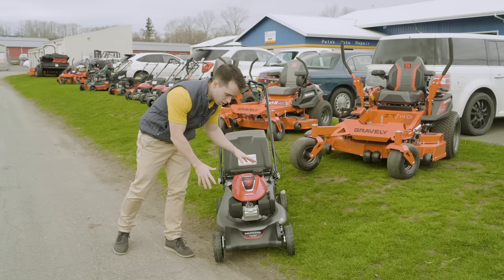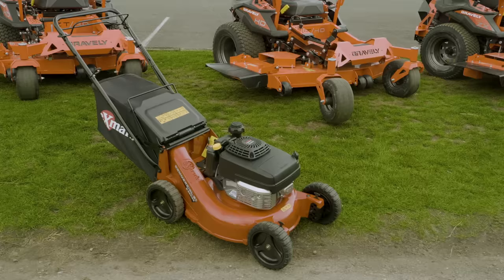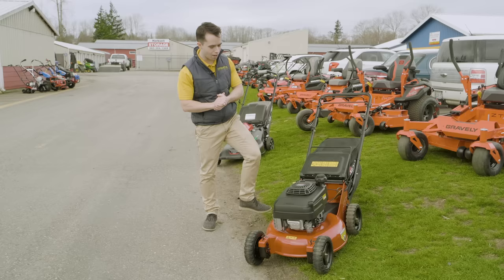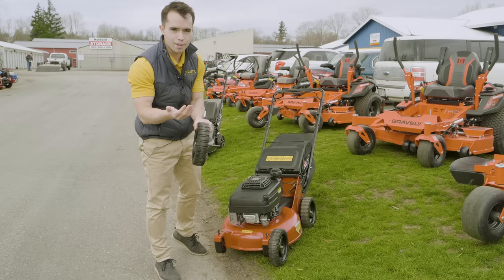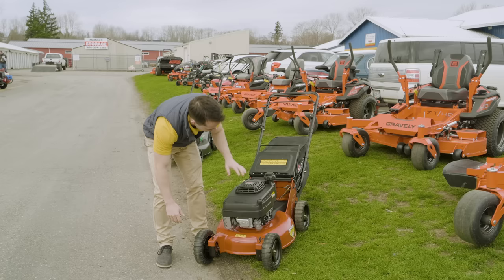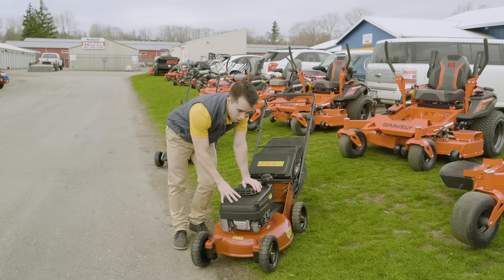It's definitely not going to cut it if you're starting to grow really big. Now let's move over to a commercial mower — this is an Exmark 21-inch mower. A 21-inch mower is pretty standard when it comes to push mowers in our industry. I don't really care about the brand; I'm just talking about general price ranges. Now we're stepping up to a commercial grade mower. This deck is much, much more solid — it's probably three times as thick. The wheels are very heavy duty, wider, and won't leave as many deep imprints into the lawn.